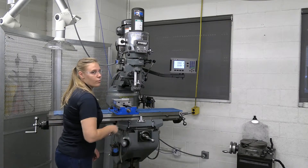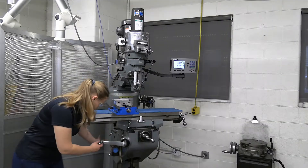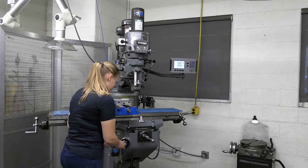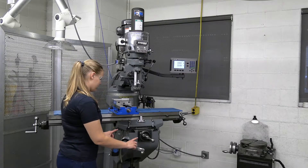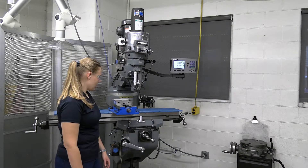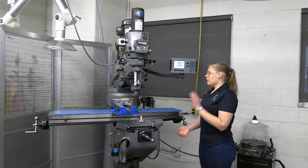The z-axis just moves up and down — up is clockwise and down is counterclockwise. You can tell easily that there is resistance when going up because the z is so heavy; it's almost like it's falling on the way down. This entire area is the z. The way you zero the z is you use the analog scale. There's a lot of slop or slack in our z-axes, so we recommend having the handle pointed in the direction you want to go — usually off to the right because you're going up — and then zero from there to reduce the slack. Each tick mark on the scale is one thousandth of an inch.